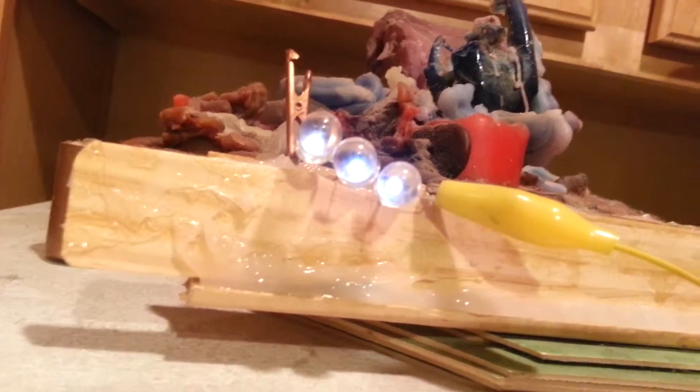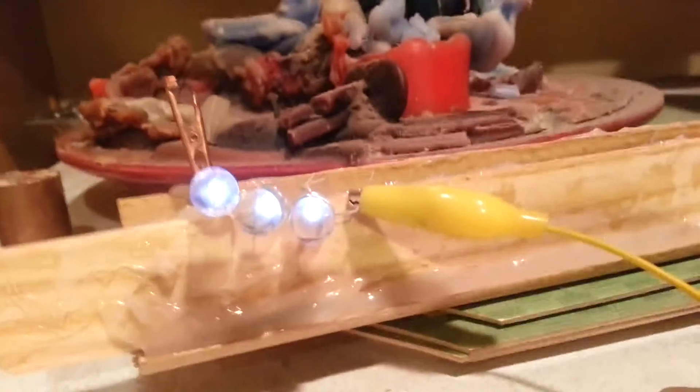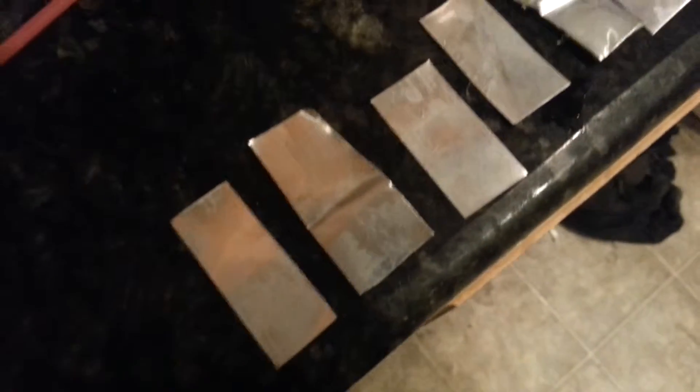I ended up flushing that out and just adding distilled water — no electrolyte, just water — and I'm going to leave that run until it runs out. These are definitely oxidized, except the last ones, because the calcium carbonate reduces the reaction, but it reduces it to the point that the battery is unusable.